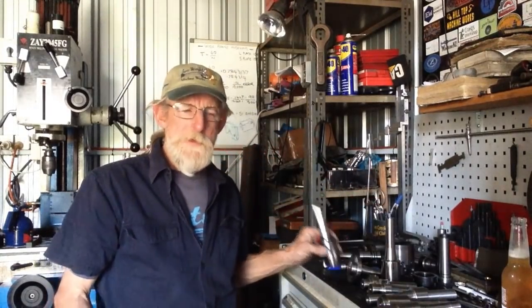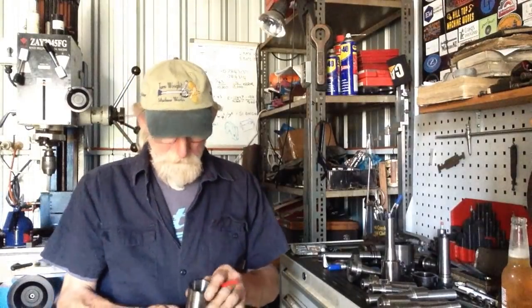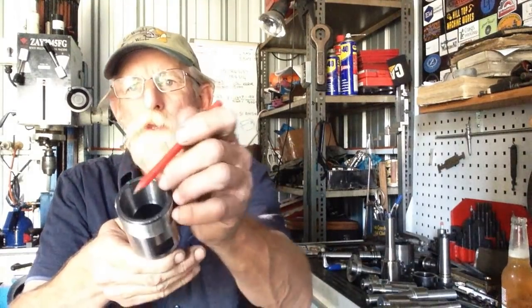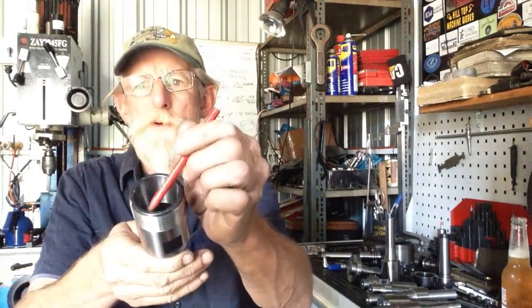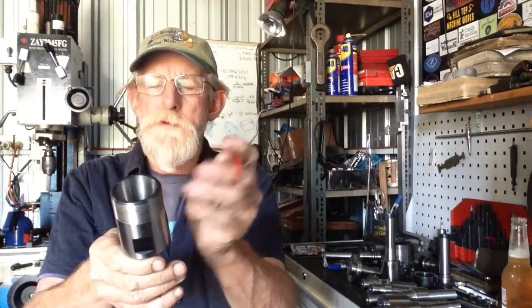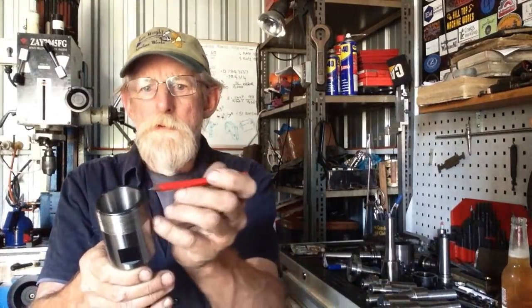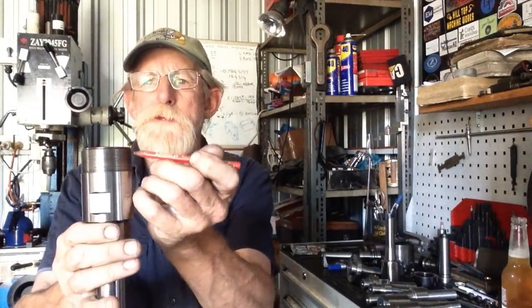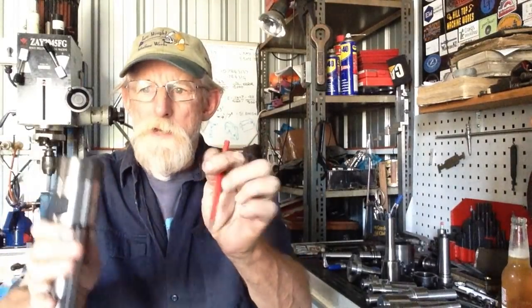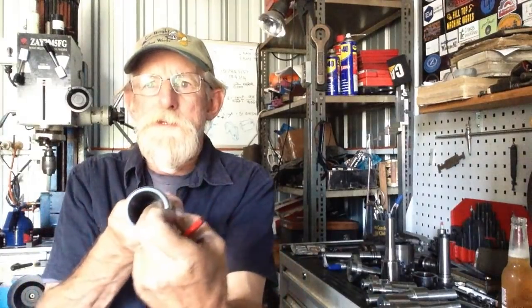Now the reason why that's going to be tricky, we've got to think about the way we're going to tackle that. These get heat treated. So you have your tapered bore inside. So when they're quenched, it's quite probable you're going to get a different expansion or a different shrinkage rate from that end to further down to here. It may come in like a carrot shape because of the thickness difference, the wall thickness changes.